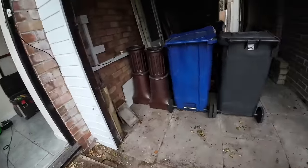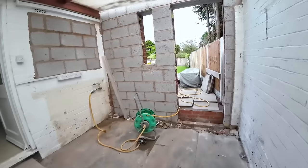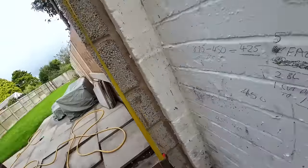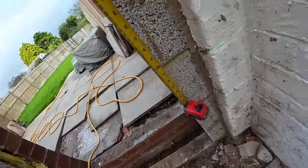So we spin it to the back. Our lintel is lower at the back because the small door was made to measure for the hole. This lintel. Just need the camera work just one handed. So this lintel is 1560 above our datum.